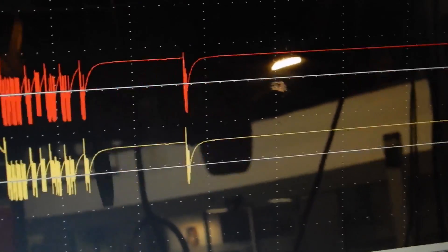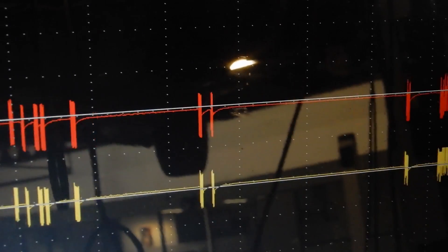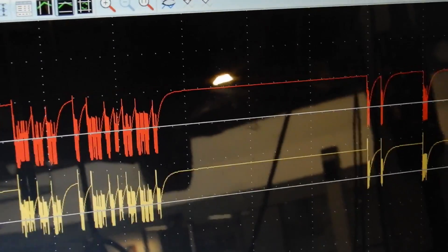This is how a FlexRay signal is supposed to look like. Disconnecting the ground causes the voltage to rise again; connecting the ground brings the signal back to normal. Disconnecting it again and the signal rises — confirming the bad ground is the cause.